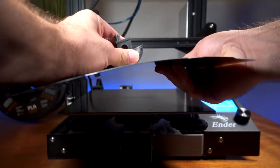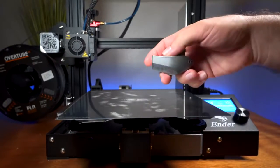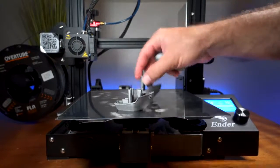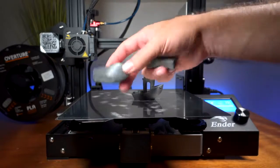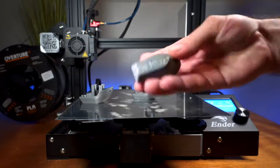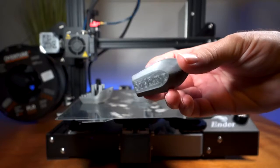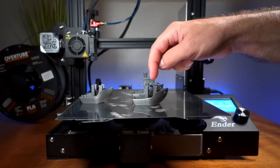And it's coming off. So here's the thing, guys, I had to use glue, and the reason for that was because the first Benchy fell off. Well, that was kind of my fault because I didn't clean it with alcohol before I printed. Plus it was a little far off the bed. And then the second time there was no excuse because it was very good against the bed, but it wasn't holding on that good. And so when I got to this part, it knocked it off.